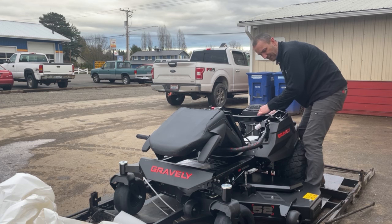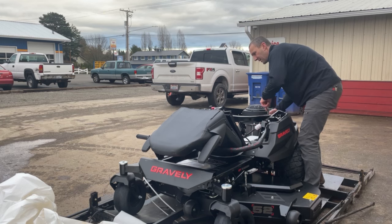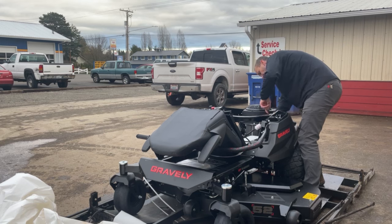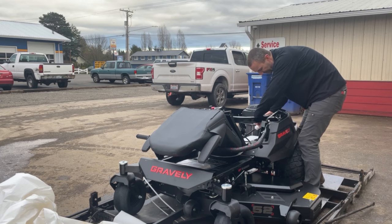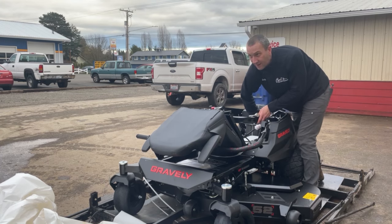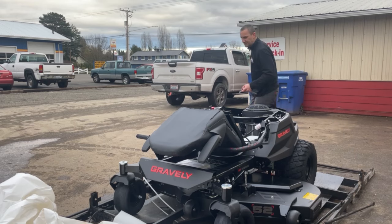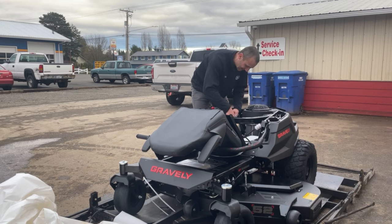We're seeing more and more fabricated deck designs out there, but this 52-inch fabricated deck is very well built. Its cut characteristics are awesome — you deal with tall grass and want to make it short and move it out in a clean spread pattern, it does a beautiful job at that. This deck has six points of suspension: two coming down from the front, and two on each of the sides — a much sturdier deck suspension system that definitely makes it stand apart from the competition.